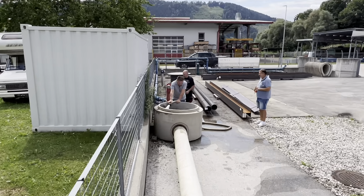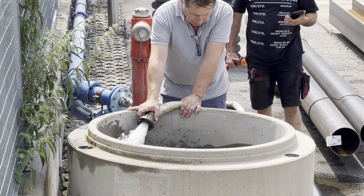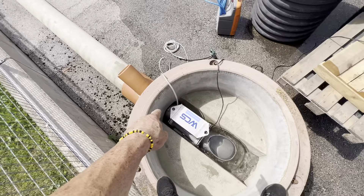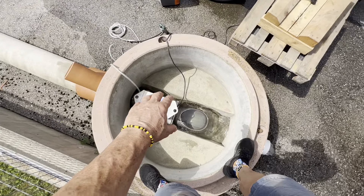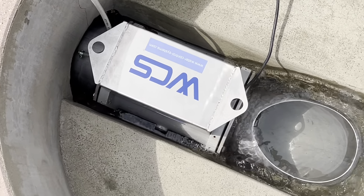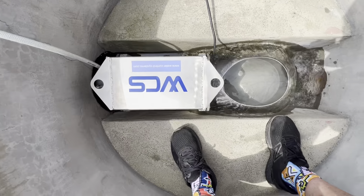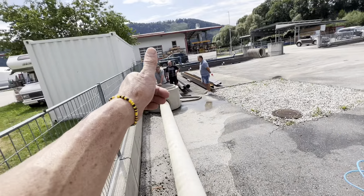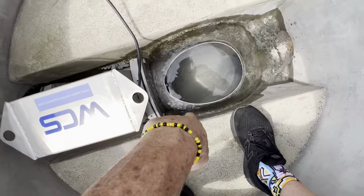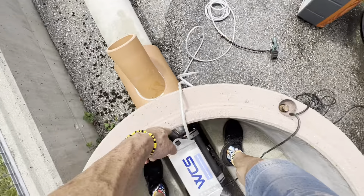We're doing some training here. What Marco is doing is simulating pushing water into that chamber. We've got a rubber bladder here. What you would do is lower this flow meter down into the manhole — you can see those two holes. This is a sewage flow meter. It surcharges into the manhole and then you'd use a small compressor to inflate the rubber bladder.